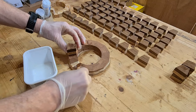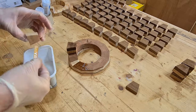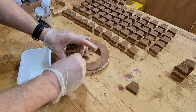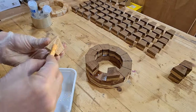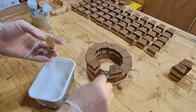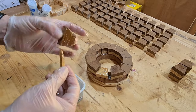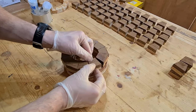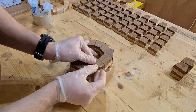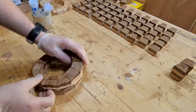There are 24 segments to each helical layer in this particular project, and I went for putting the oak and the mahogany piece together as a pair, gluing those in before moving on to the next one. The problem wasn't so much the order in which I was assembling the wedges — I think it could have been better affected by using a 30-minute epoxy. The whole assembly time for a single helical layer was probably about 12 to 14 minutes, so the first pieces laid down were getting very tacky and difficult to move.